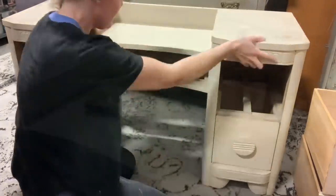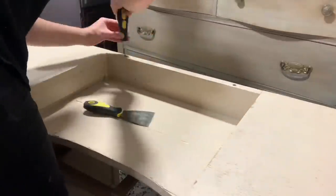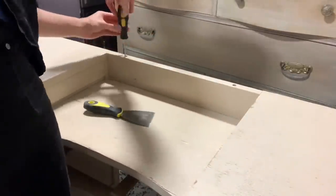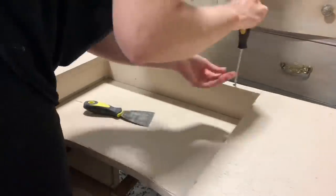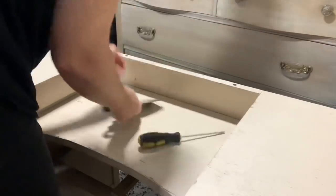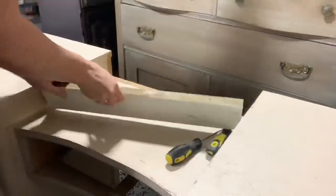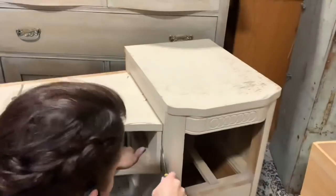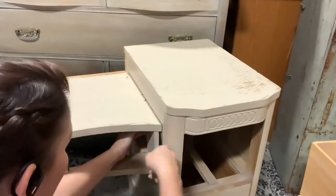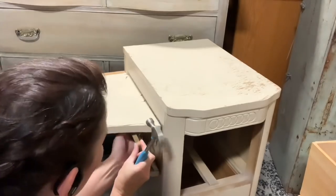This is damaging the veneer on the sides and I know it's going to need to be filled, so it's just something I'm prepared for. If you wanted to do this without any damage, I honestly don't think you could. I've done some without any damage — it usually is the ones put together with screws. This one was nails and glue, which makes it really hard to get things off without messing the wood up.